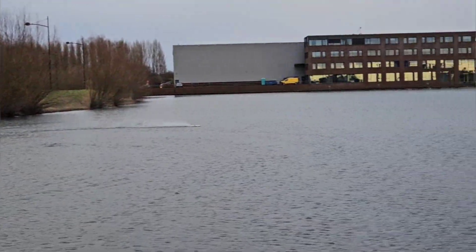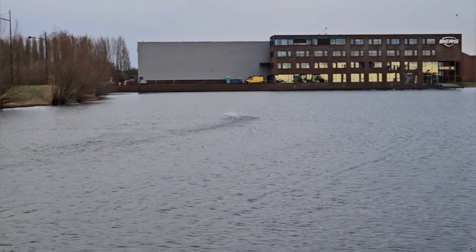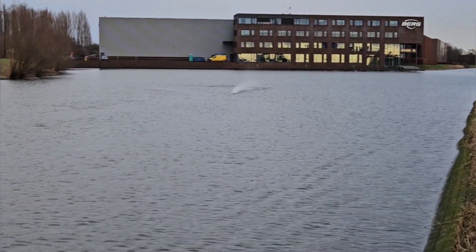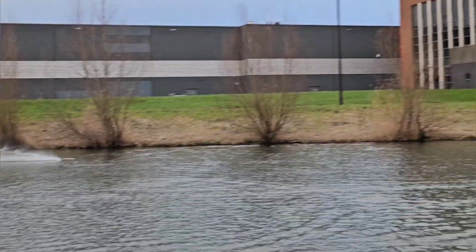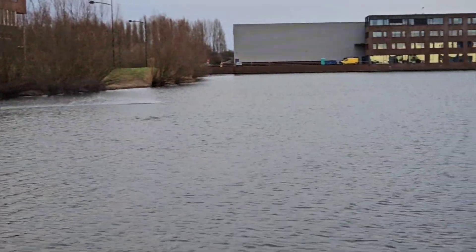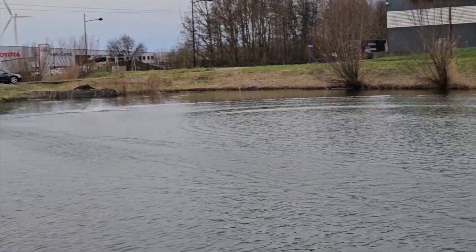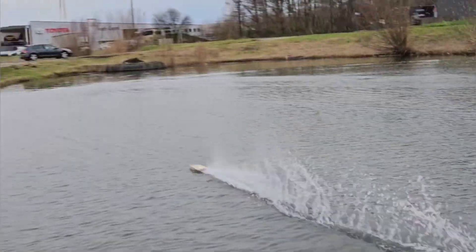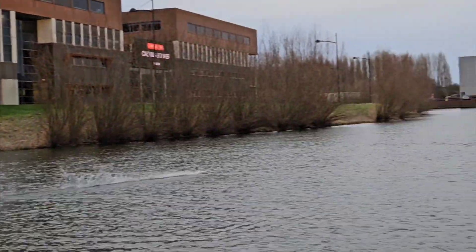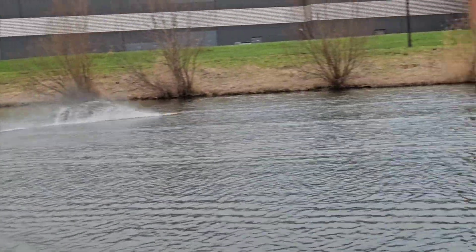It still corners a little bit less when I push it with these lifting strakes, but it's definitely improved already by removing the inside ones. I'm going to remove the outside lifting strakes as well — I'm pretty convinced now. Cooling works well. What a fun little boat. This boat is really the surprise of 2024.